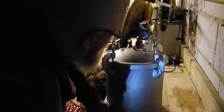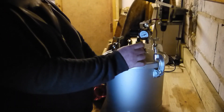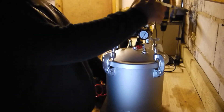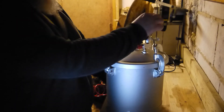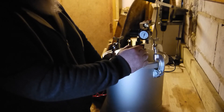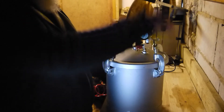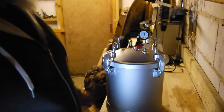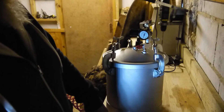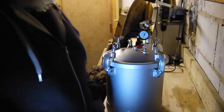That's holding its pressure perfectly. If you want to release the pressure, there are two ways — you can pull the blow-off valve to release all the pressure, but once all the pressure's gone then it's safe to undo it. Never undo it before, or it will probably take your face off. Thanks guys — like, subscribe, and comment. I'm sure you guys know something I've done wrong, but it seems fine to me. Thanks a lot!